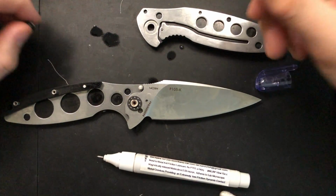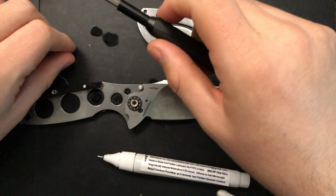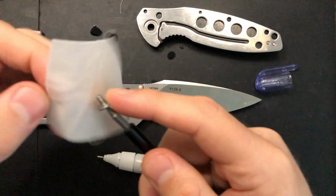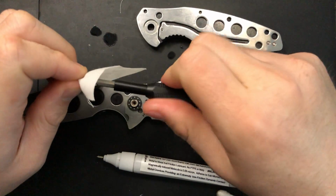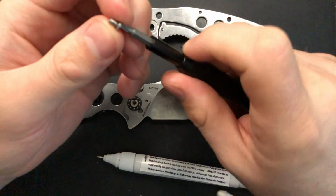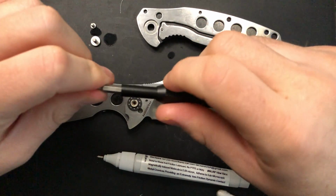Usually, once you break a Threadlocker, it's kind of broken, which is good and bad. It means that you don't have to worry about it in the future, but it also does mean that you need to reapply it if you want your threads to remain locked. But I'm not going to apply the red stuff because I'm not in cahoots with the Red Devil. I am instead just going to apply an intermediate strength blue Loctite and clean off these screws a little bit just to make sure.